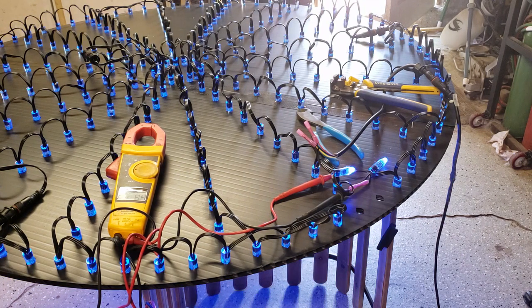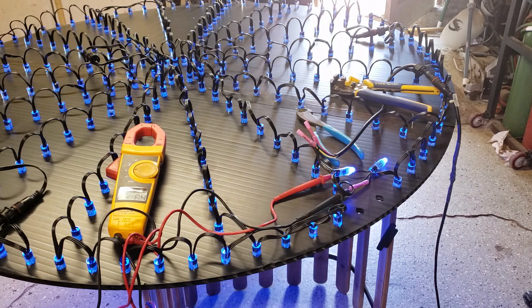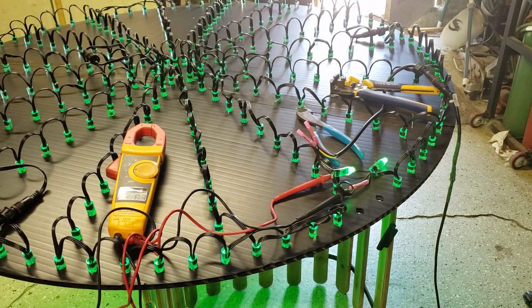But there are some ways you can actually help mitigate this and not have this voltage drop at the last pixel like we have here, which causes a difference between the first pixel and the last pixel in how bright they are. I'm going to make a bunch of changes to this particular spinner and walk you through the changes I make and why, and then show you the end result — how this can help you in a large element like this to manage your power, allowing you to run many more pixels off a single output.